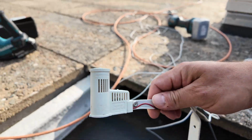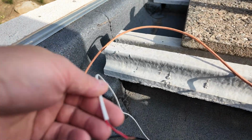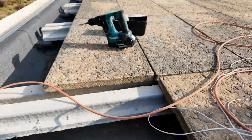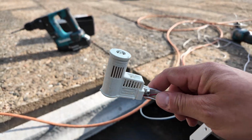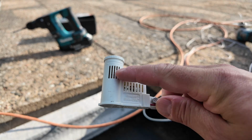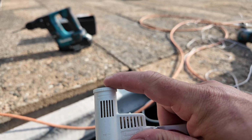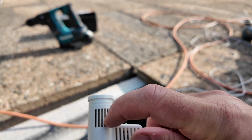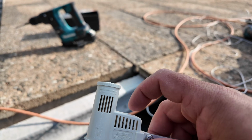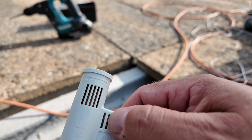And this one is the very well known click rain sensor. This one requires only a simple 2 wire, so it's possibly some kind of mechanical solution to detect rain. I think there is a little disc inside with a kind of spongy material, so when rain hits this top hole, these spongy rings expand and put pressure on a micro switch, which is somewhere inside.